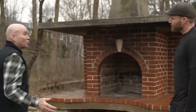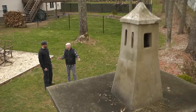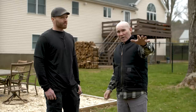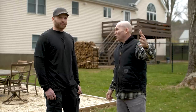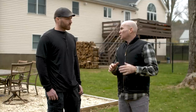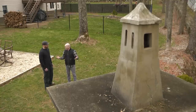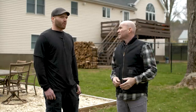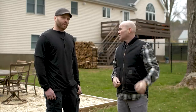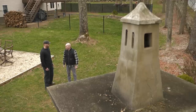Overall, I think everything looks great. The good news is this oven seems to be structurally sound. All we're going to have to do is just cut open these joints and repoint them. But the culprit here seems to be water infiltration, which is a huge problem up in New England. Because once water infiltrates masonry, it turns to ice, which pushes the masonry all over the place. I just want to make sure where the source of the water is coming from, fix that, and then we can do our major repairs.